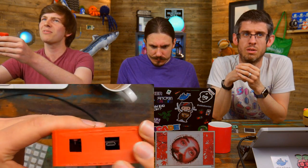So that other one, that's made with an Adafruit Trellis? Yes, this is actually from you guys. A silicon button there goes onto this driver board, which has a load of LEDs in, and then you can see how it comes up into this. Underneath it, you might be able to see just the USB port, in there is an Arduino. And that's basically all there is to it. There's a bit of clever software in there, but essentially it's just some buttons and an Arduino. Alongside this, I did a load of desktop software to actually program it.